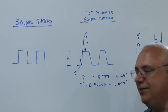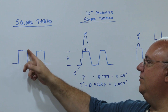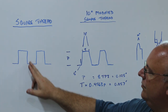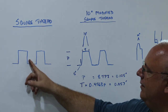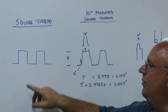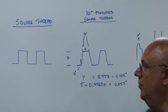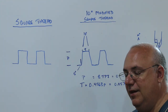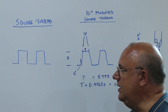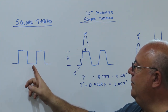Over at the whiteboard, I want to show you the difference in these threads. A square thread has 90 degrees on each shoulder. From a machining standpoint, you have drag on your tool — you have to relieve it back to get in there, and you're plunging straight in, doing your cut on the bottom, whereas what you really like to do on threading is cut on the side. It's completely doable; I've actually cut square threads before, but it's difficult.